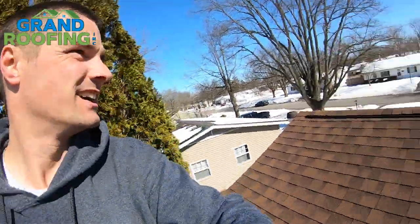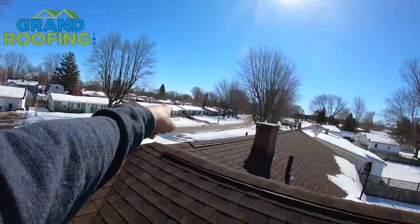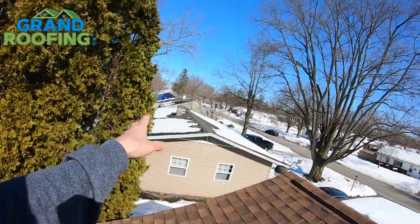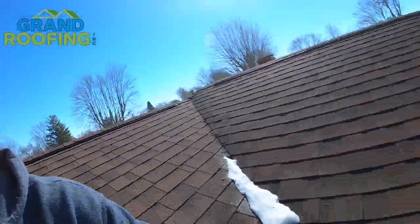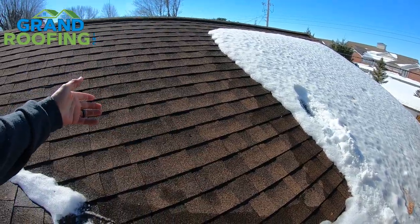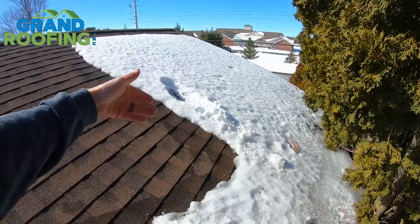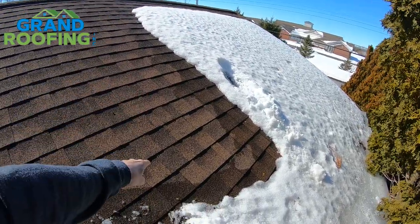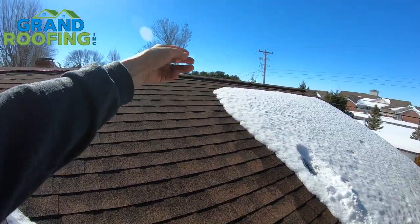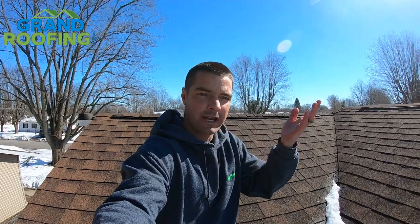If you look around here, a lot of these roofs are snow-covered. This one is significantly less snow-covered, and the one down there is pretty significantly uncovered of snow. I've got a black roof and it's still solidly covered with eight to ten inches of snow. This one's fairly dark but has way less snow — not due to the color. You might think a black roof is going to heat up more from the sun — not necessarily. If the roof is covered with snow, it's reflecting the sun's rays. But if you have a small area starting to clear, it'll warm up, melt, heat up more, and start a chain reaction. The bigger thing is what's causing this is the warmth radiating through from your attic.